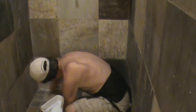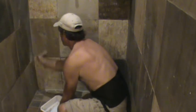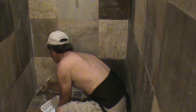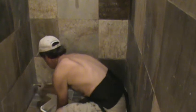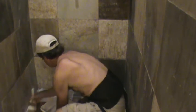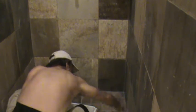Dip and go, dip and go. Get too much and I can just taper it out. Always thinking about my rolling. I have enough on there. Wipe off any excess as you go. I'm getting it up plenty high. That way I don't have to get the roller all the way down. I just move it out. Just like that. Keep going. Okay, I'm almost ready for the roller. Well, I'll finish this up, the cut in, and then show you the roller next.